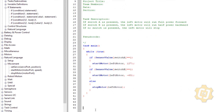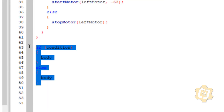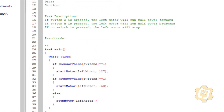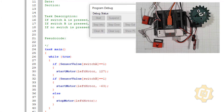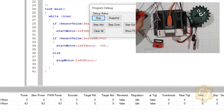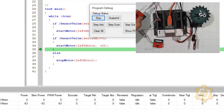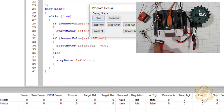And I have this one here — this is the one that I really like. If I drag this over it automatically gives me an if and an else together. I said a minute ago that you can't have a whole bunch of ifs and just one else — this else is only tied to this if. But there's going to be another problem as well. When I download to the robot and hit start — starting with switch B: negative 63, it stops just like it's supposed to. Now switch A — it's not working because that other else is stopping it all the time. Both at the same time? They're conflicting.